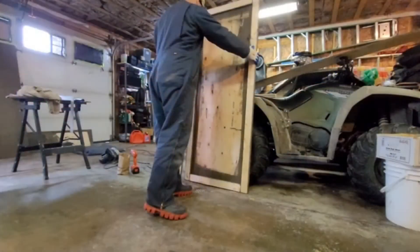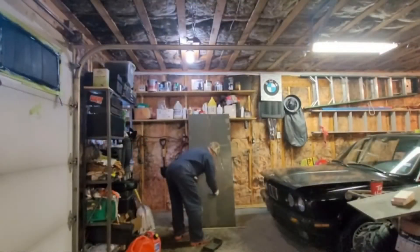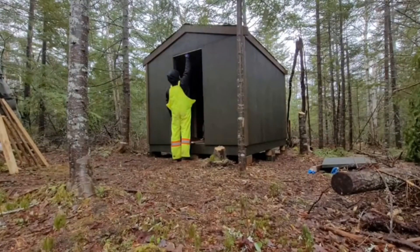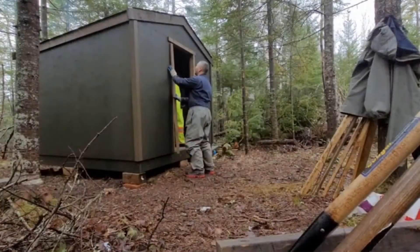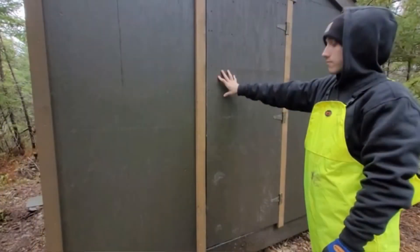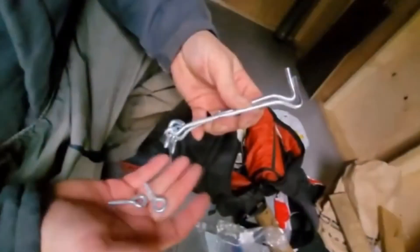I made the door with plywood and a double sided strapping in the middle. I put a coat of stain on it. I made it good and heavy and strong. I hung it with 3 barn hinges. In the trim I used strapping. I made sure it was dry and I coated both sides before I installed it, and that will protect it and make it last a long time.